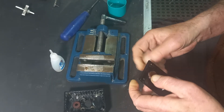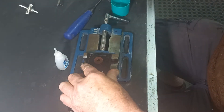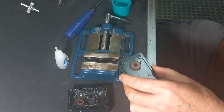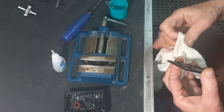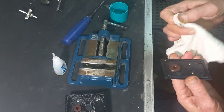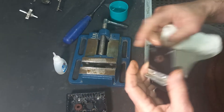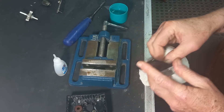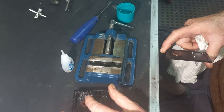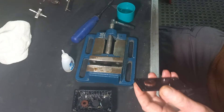It's got to come right through and possibly pin it slightly as well. You can wipe away the excess. Making sure it comes through there — it's almost level — and now it's in exactly the same position that it was in. So if that bush has gone back exactly as it came out, there's nowhere on the back plate or the back tufnol plate, then when I put this gear in it should line up.